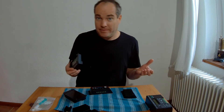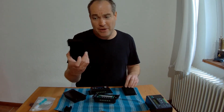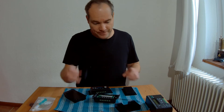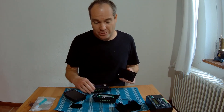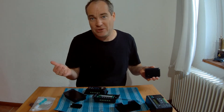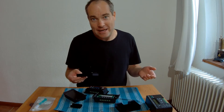The second thing — and this is in most cases necessary, especially in tropical areas — is to add an additional heatsink, and it's pretty easy. You have different types of heatsinks: this is a larger one, this is a small one good enough for the 10 amp version, and this is what I chose for the 30 amp version and it works well. You have to buy an extra heatsink, which is not that expensive. This charge controller costs only six to fifteen dollars or euros, and this heatsink costs maybe four to six dollars, so you nearly double the price — but it works, and that's still an acceptable price point.